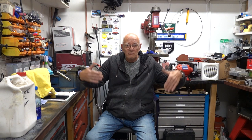To give you an example, at the back of the vehicle, right across the back underneath, there's the wrap under, and it just ended. And the auto crews who'd built this thing just put a rubber piece of matting that hung down over it. When you lifted it up and looked underneath, it was really thin fiberglass, no support whatsoever. So I bonded stainless tubing into that, all the way along. So I actually made it a lot stronger than the original.